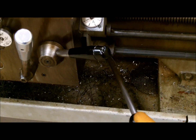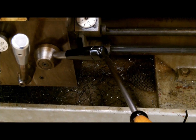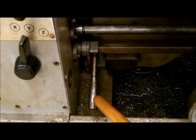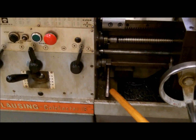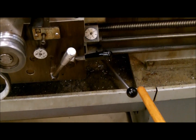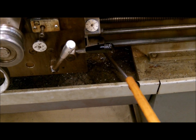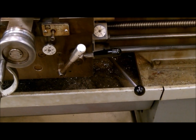This is one of your clutch engagement levers — this is what actually engages the clutch to allow the spindle to rotate. There is another one on this edge. The lever on the left of the machine will only engage in a forward rotation by simply lifting it upwards. When lifted up, it starts the clutch in a forward rotation. It will also function in reverse: you move the lever outwards towards the tailstock and down, and it will cause a reverse rotation.